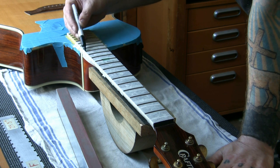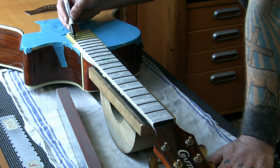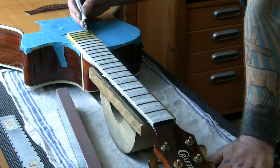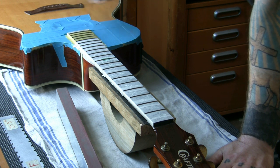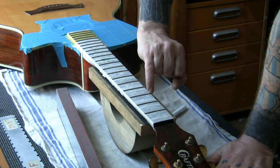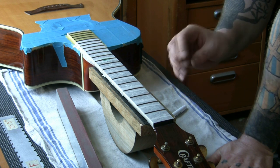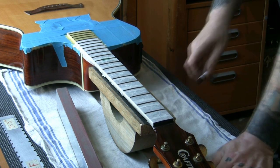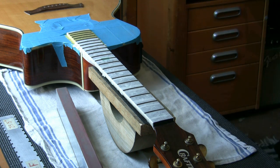I'll probably move the camera or zoom in for the crowning. The reason I put black marker pen on is so I can see what I'm doing when re-crowning. I put a thick black line across the top of the fret, and when filing to build up a crown, I leave a line down the center — that line is the contact point between the top of the fret and the bottom of the string. Ideally we want about 0.4–0.5mm; with quite thin frets I'll go to 0.3.